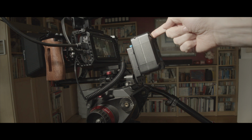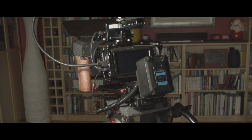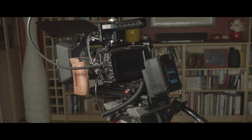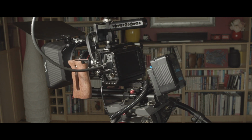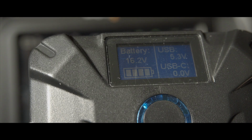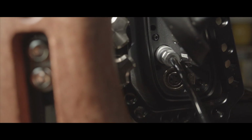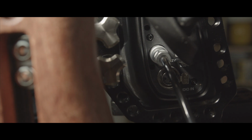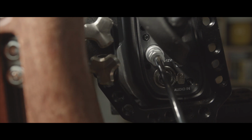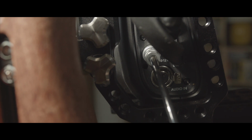As I mentioned earlier, I use an external battery pack. The most popular and flexible format is what's known as a V-mount battery. I use the Nano 2 because it's 100 watt-hours, but significantly smaller and lighter than most equivalent brands of the same capacity. The battery feeds the 12V DC port on the Pocket Cinema camera. It powers the camera for about 5 hours, which, allowing for setup changes, direction and so on, is realistically all-day shooting.